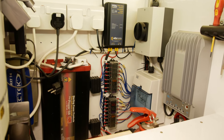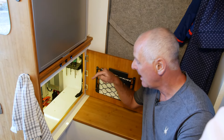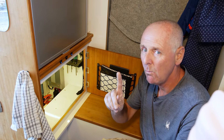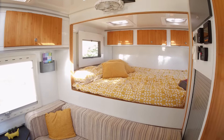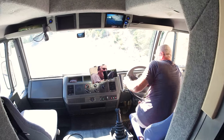Down here is the bulk of the electrics — a very simple system. The house batteries are wired at 24 volts; everything I could source at 24 volts I did — water pump, electric space heaters, and so on. I then have a 12-volt dropper for items I couldn't get at 24 volts, like the cooker ignition and all the LEDs. It's a one-wire system: one wire from the batteries to a fuse, to a switch, and then to the appliance and back. So if something goes wrong it doesn't affect anything else and fault-finding is easy. The philosophy — keep it small, light, and simple — has proved very successful.